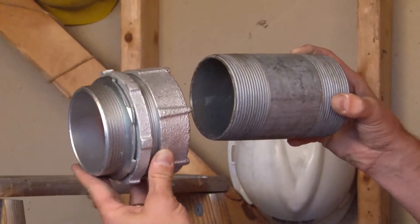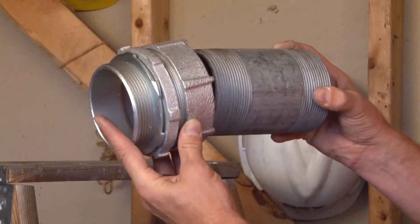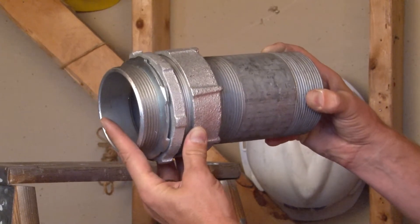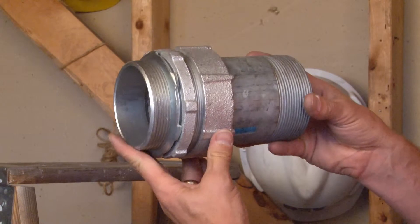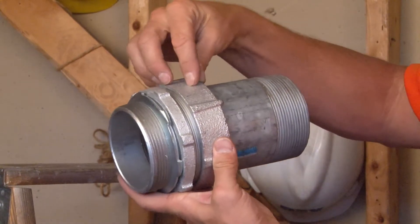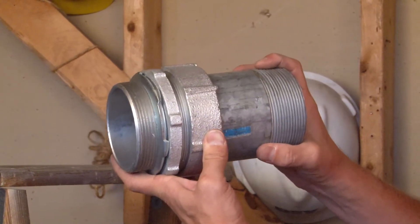The way they install is quite simple. You place the open end of the fitting directly over the threaded portion of the conduit until it hits the stopper in the middle of the fitting. Once it hits the stopper, you simply tighten this gland ring which bites down on the conduit, locking it in place.